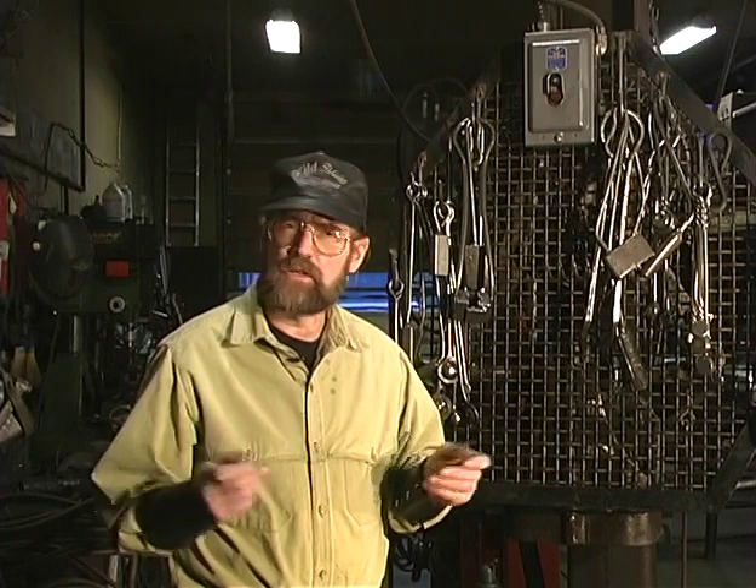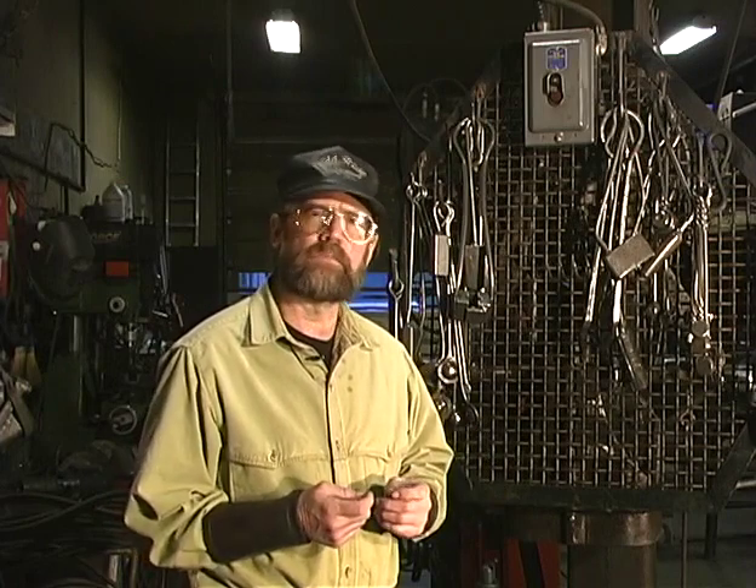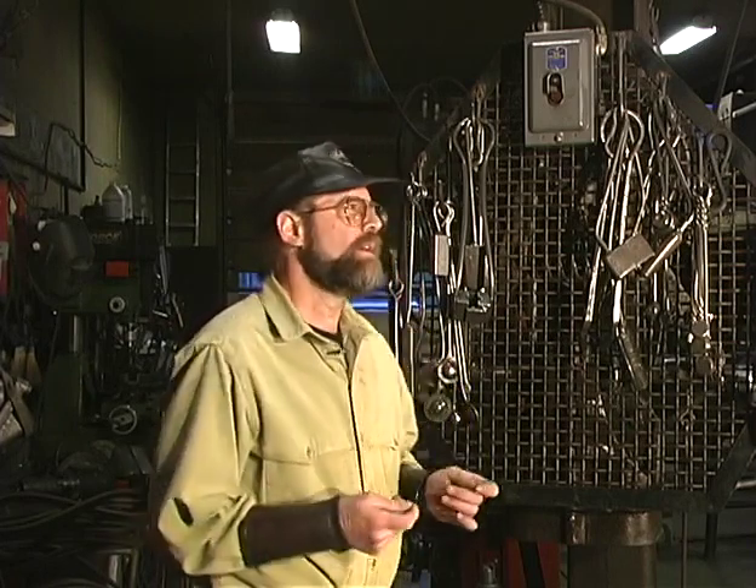I'm always amazed when I look at these old hammers. The two that I have here in the shop are completely worn out when I got them — so badly worn that they couldn't have struck two consecutive solid blows in the last 1,500 hours they ran. These hammers were used to sharpen chisel points; the dies in them made that quite clear. For what they were doing, it didn't matter if the hammer ran four or five hits after the work was pulled away, or only hit once every three times. It was still easier than using a hand hammer. But what we're trying to do today with these hammers is far more complex and delicate forgings than they were ever designed to do — and with a few simple modifications, we can make huge improvements over the original efficiency.